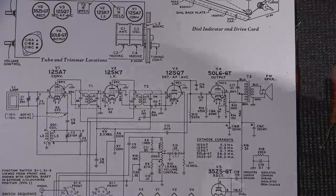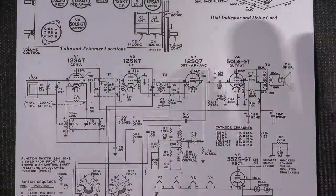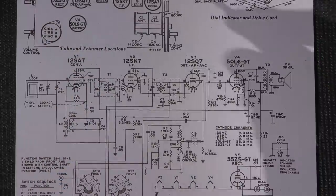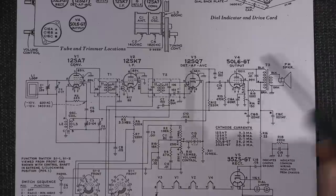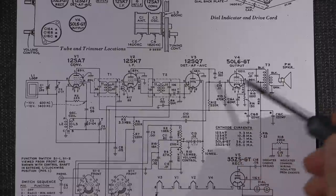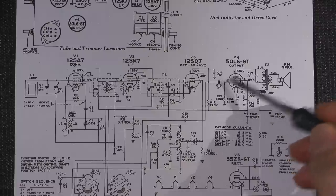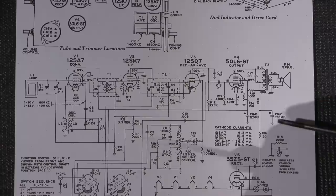Now, I know a lot of you that buy these old tube amplifiers say that, oh, they sound so nice with the factory capacitors. You open them up and in the bottom there's bumblebees or dye film caps or some dye film cap lookalikes. But if you measure the control grid voltage with just a standard DMM to ground, you'll a lot of the times see a positive voltage on the control grid, a very high positive voltage, which is not a good situation.